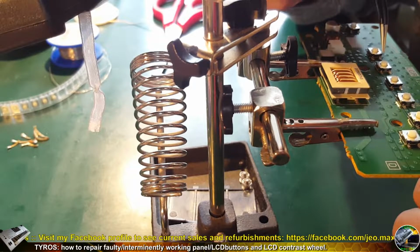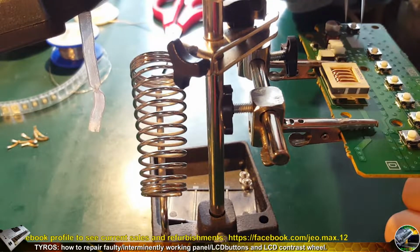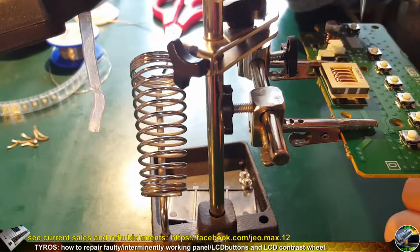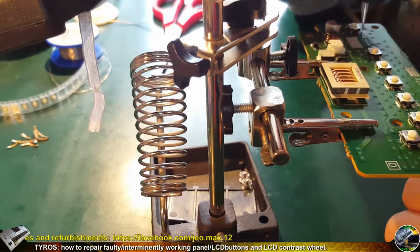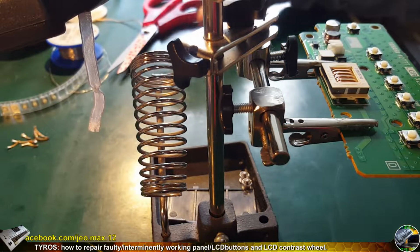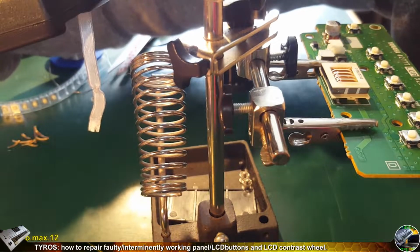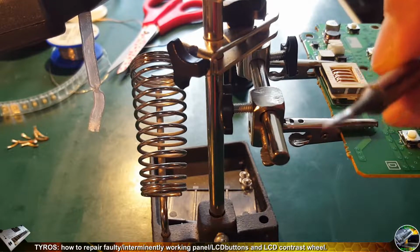Sometimes it happens, because if you solder the second terminal, it's over. You cannot change its position. So you can change the position only with 1 terminal soldered in, because, I will show you in a second, with one hand with the tweezers you can change its position, and with the second hand you use the soldering tip to melt down the solder, so it will allow moving the element over the PCB.